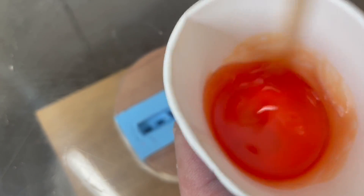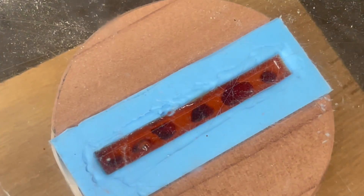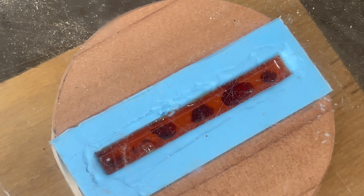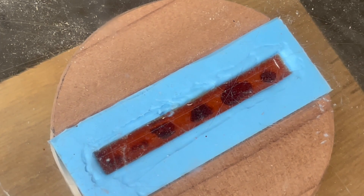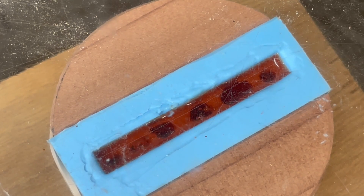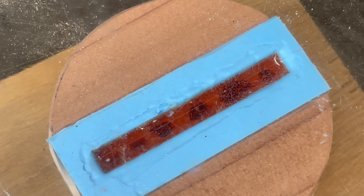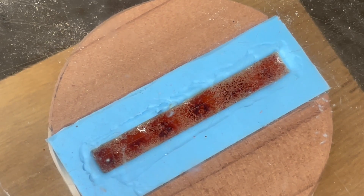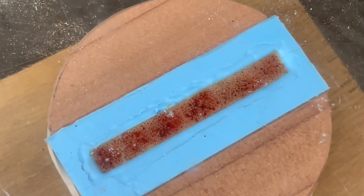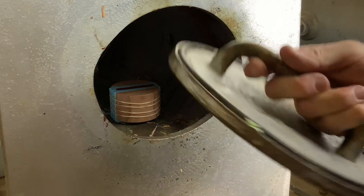The resin is mixing, the mold is assembled, and it's down in the vacuum chamber. Let's see if we can pull some bubbles out of these cavities. Look at those bubbles come popping out of there! That's definitely the air trapped down in those cavities — not the resin foaming — definitely air coming out. The arms and fingers are closest to us and they're going to be the hardest ones to get resin down into. Now the resin is beginning to foam, which tells me we're about done and I need to turn the vacuum chamber off. I'm topping off the mold at the pressure pot to make sure I have enough resin in the well so I don't starve any of the cavities.